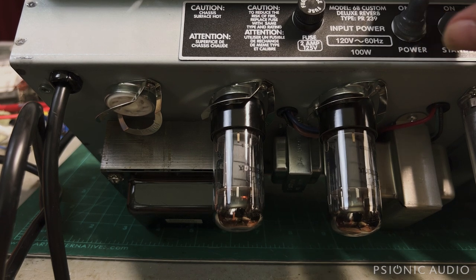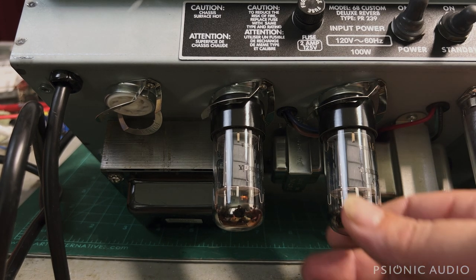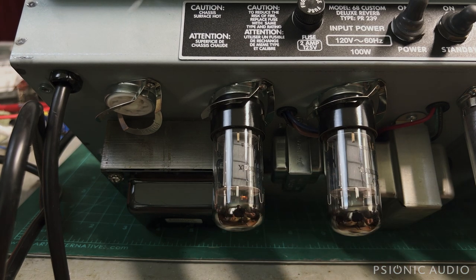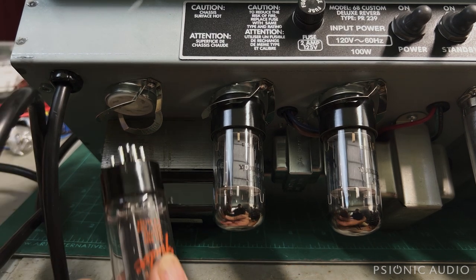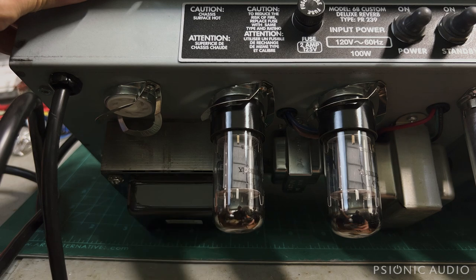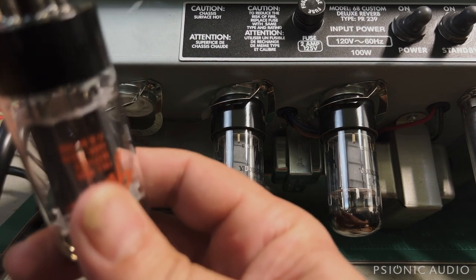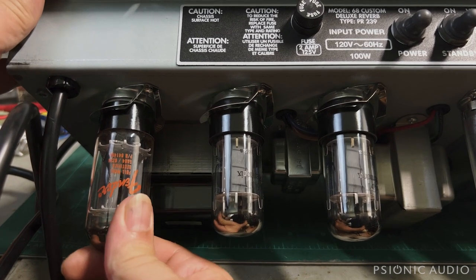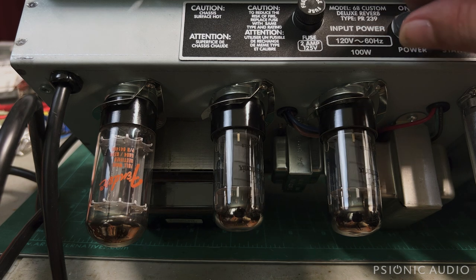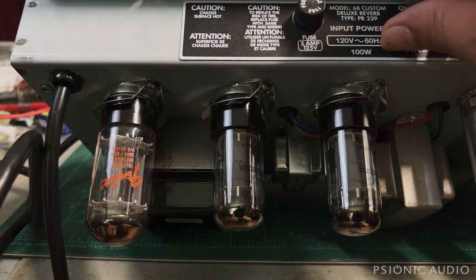No real illumination on the limiter — light is coming on, no sparks in the output tubes. My money's on the rectifier tube, because rectifier tubes fail more than any other tube in the amp and are known for taking out a fuse. This amp, like most Fenders, doesn't have a separate HT fuse — just the mains fuse. I'm ready to power it off immediately; I wouldn't be surprised if we get a bit of a light show.